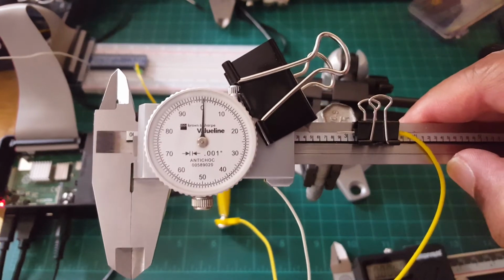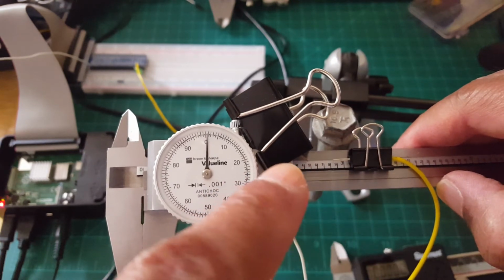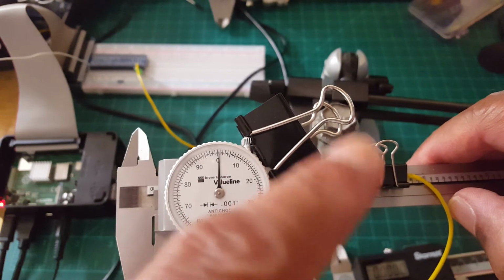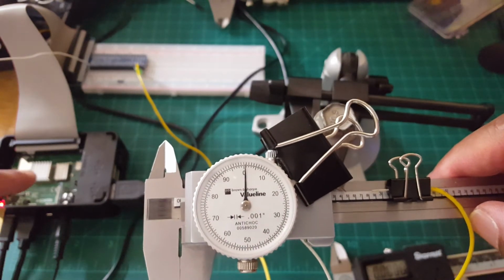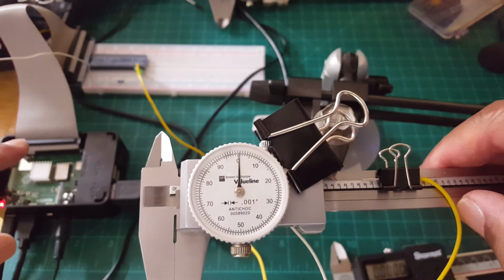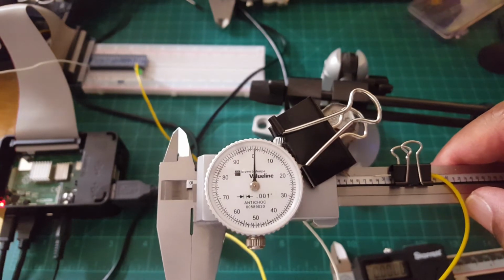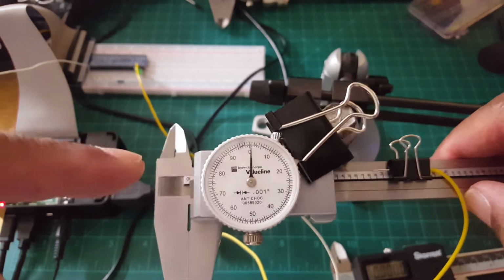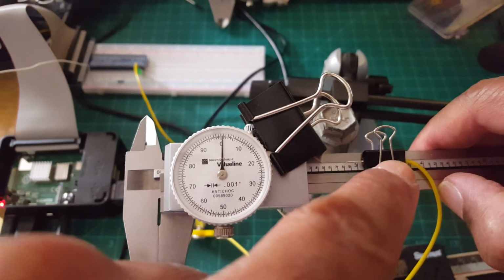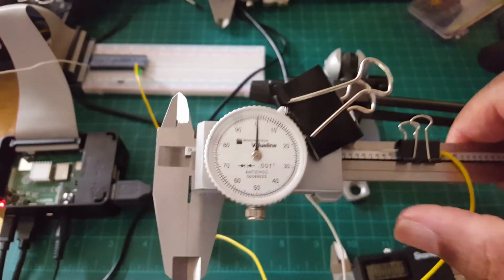I just basically took, as you can see, 2 binder clips. I have what I call sense wires, and those sense wires, when they touch each other, they complete a circuit, and then the little brains here, which is a Raspberry Pi 4, it's the latest one. This is like an 8 gig little mini computer. I wrote some software in Python, and now it can actually read what that value is based on the position that you see here. This is my little adjuster, and it'll actually read the value, and it'll basically turn on that LED, and there you have it.